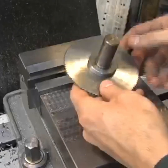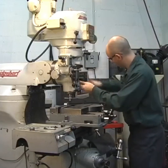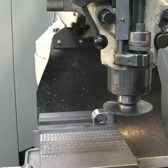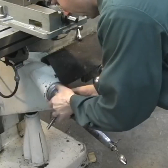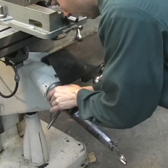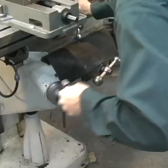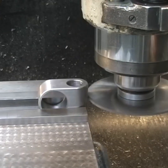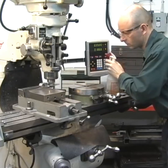The last operation for this part is to slit it. This is a slitting saw on a homemade arbor. I use the quill on the Bridgeport to bring the saw blade down to just touch the top of the workpiece and lock the quill in place. Then I use the knee adjustment — zero the scale and crank the table up to the exact height I want using the dial. Once the saw is exactly where I want it to be, I simply feed it in by hand, keeping lots of lubricant handy in the spray bottle.